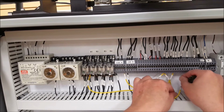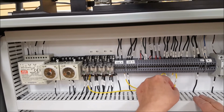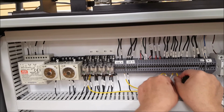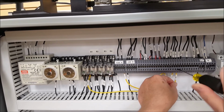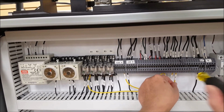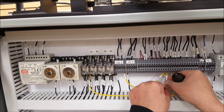And then the second one's the other part of that, which is going to our start button. That's wire number 6 we're going to go to here. So we're jumping wire number 2 to wire number 6. A direct jumper right here. Tighten her down. Feel it bite in there. Give it a little tug, and okay, we're good to go. So node 2 is completely done now.